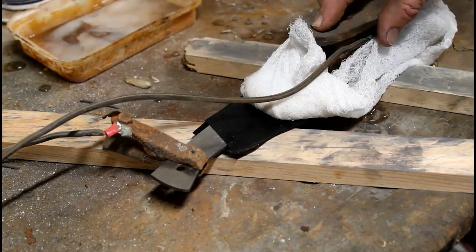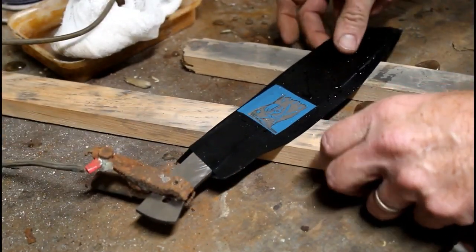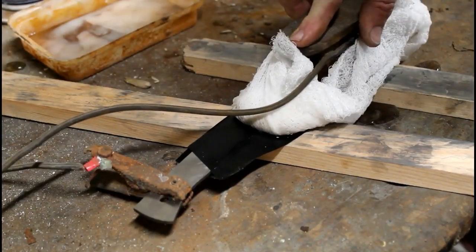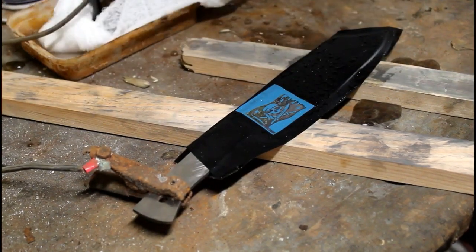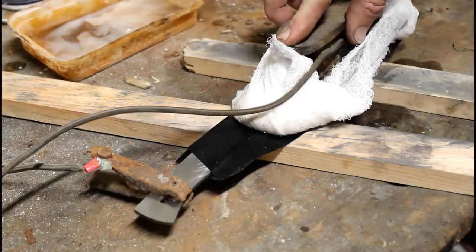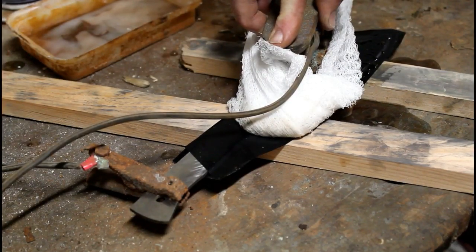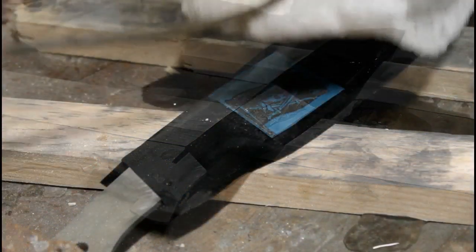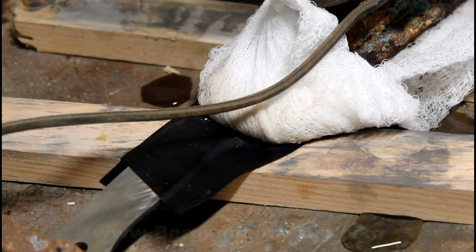I turn the charger on and apply that electro plate to the area I want etched, doing this in 10 to 20 second increments. I don't want the vinyl or the blade to get overheated and that vinyl to lose its self-adhesion. I've got the blade suspended on two small pieces of wood so that it doesn't end up sitting in a puddle of electrolyte solution — my concern is always unwanted etching on the backside or another spot on the blade. After every minute, I'll actually cool that blade in water to bring down the temperature.